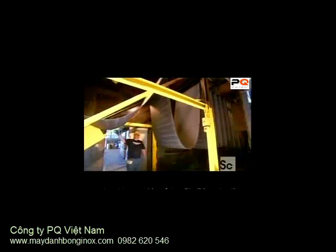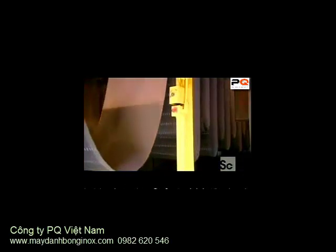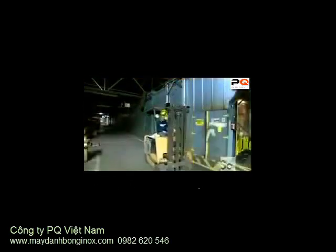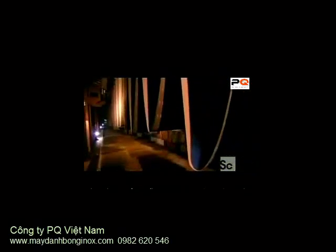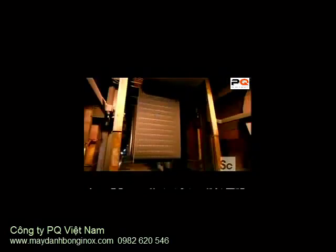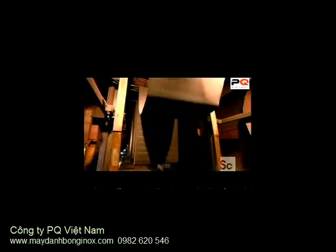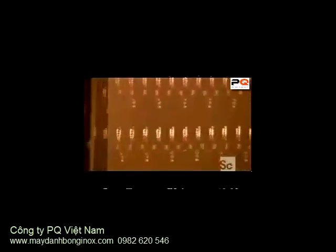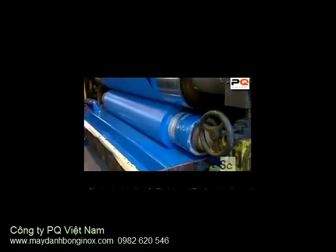This production run gets the go-ahead, so workers move the sandpaper through a 100-yard-long oven. It has 3 different heating zones, each progressively hotter. The increasing heat bakes the grains into the adhesive. The sandpaper is now rough enough, but it's not quite ready for use. In the next step, a coat of resin is rolled over the gritty surface, binding the grains to the base.